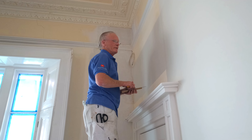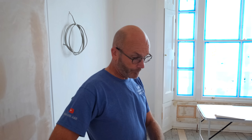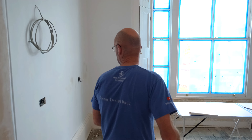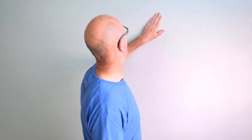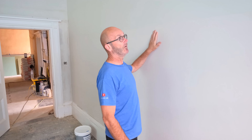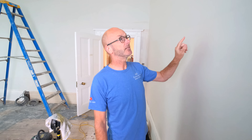Then you use a sponge and water to sponge the edges off to remove any residue paste — you don't want that on there. Always wipe the joints with the sponge and water. We did this one earlier and as you can see, you can hardly see the joints. When we've painted this, it'll look like it's been plastered — you won't even see any of the joints, and we won't need to put filler in them.